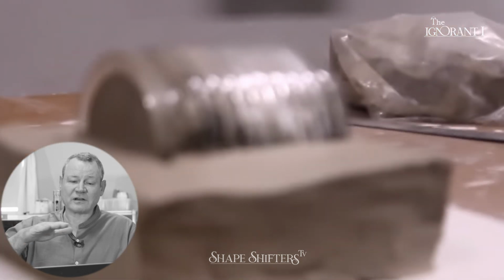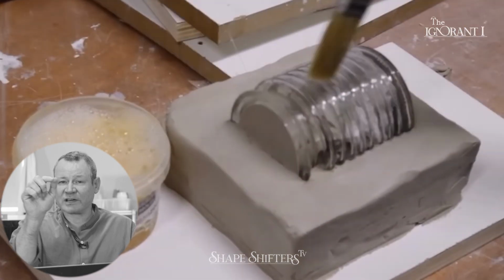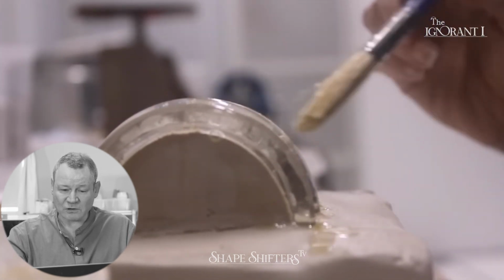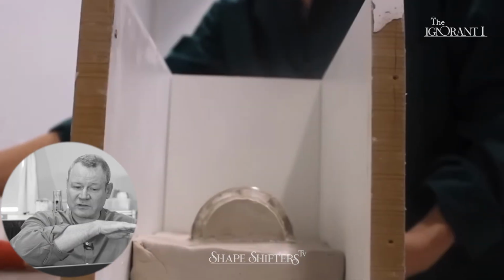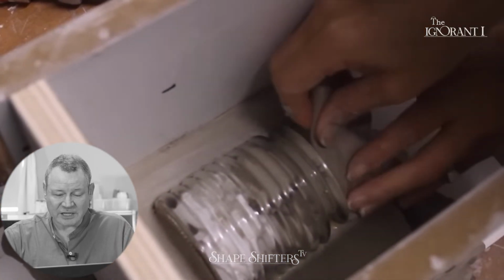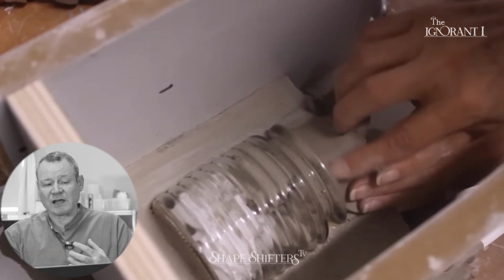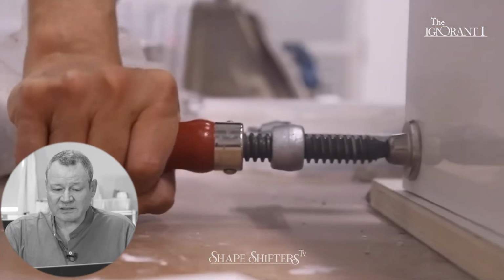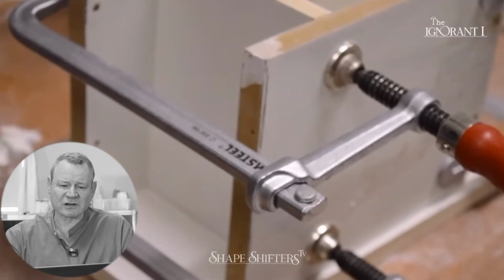Now, when you're dragging across a wall like that, if you have a short tool and a wide wall, you're always going to cut in steps. You need to have a wide tool dragging across that, like a ruler or a long knife, because otherwise, every time you drag, you just keep accentuating the contours that you've put in there rather than forcing the contours to be flat. These clamps, I don't know what type of clamps these are called. I can't think of it at the minute, but they get in the way of the mold box. Now you gotta work around them, and if you spill plaster on them, then you're picking plaster out of the threads. So they're good clamps, but I think they're not good for mold making. They take time. You could use a trigger clamp and be there faster.